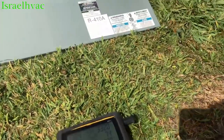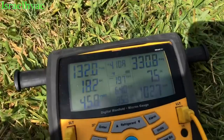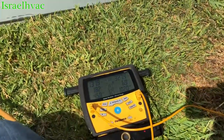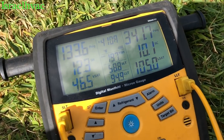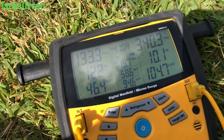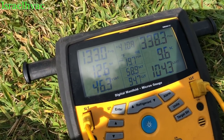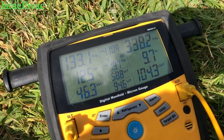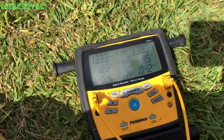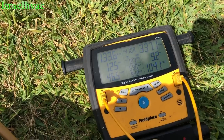Okay, it came up a little bit. Got it to 7, and it looks like it wants to climb up to about 8. I knew it wasn't going to take much — I just put a little squirt in there. I'll let that settle down for a few minutes. I'm a lot happier with that — 10 degrees of sub-cooling, 12 degrees superheat. That's much better. I bet I didn't even put a pound in — maybe half a pound. The expansion valve is playing a little bit; it'll drop down to about 8, then come back up to 10, which is normal. We're hovering right at 9.5, which I'm fine with. It drops down to 8 — still fine — then comes back up to 10. I think we're good.